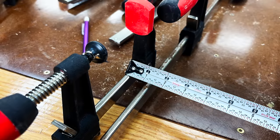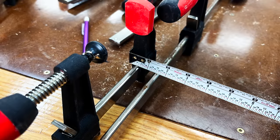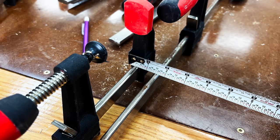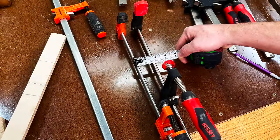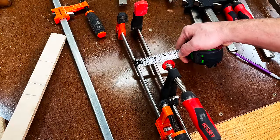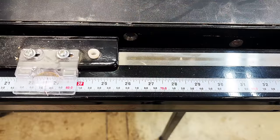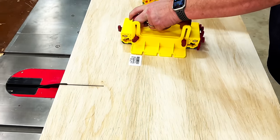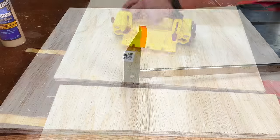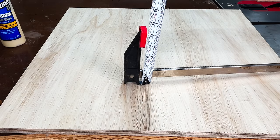The first thing I want to do is measure the bar and the jaw of the clamp. In this case we have 3/8 of an inch for the bar and 3/4 of an inch for the jaw. I also want to consider how far apart each clamp sits — about 2 inches apart. If I want each rack to hold 12 clamps with a 2-inch overhang on either side, I need to cut a strip down at 26 inches. I also need to figure out how deep the notches need to be to support the clamp — in this case about 3 and a half inches.